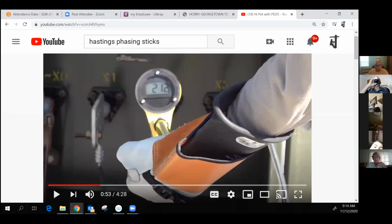The plus or minus 5%. It's within the plus or minus 5%. Thank you very much for giving that answer. But you'll notice there's nothing connected to it. There's no secondary cables connected to it. And transformers, I don't want to say instinctively, are built so that they're going to run a little bit high on their output voltage when nothing is connected to them, within plus or minus 5%. So he's 4 volts above 208, but there's no amperage or voltage draw off of it. So that's why it reads a little bit high on that meter. I just wanted to give that explanation for you right there.